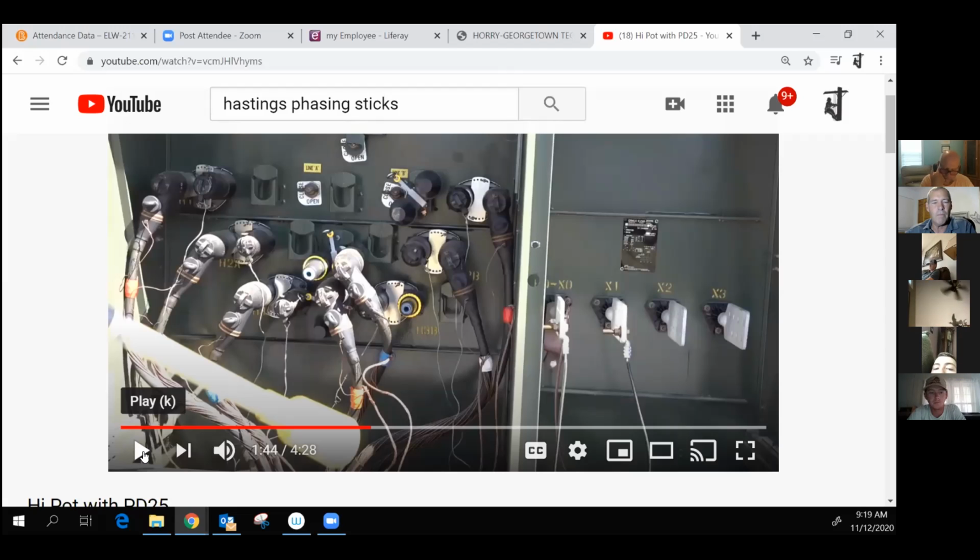How about underground? When are you guys going to be able to work anything energized underground? I'd reckon the same amount of time. Surprisingly, you can start working energized underground right away because everything is done with a stick. Overhead, you're going to be hands-on. Underground, all movement of conductors and working with things inside transformers and pad mounted equipment, your switch gears and your three phase enclosures is done with a stick.